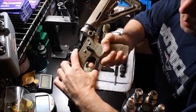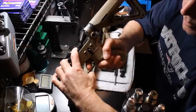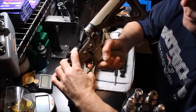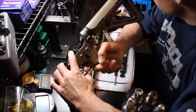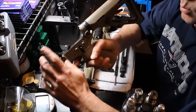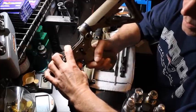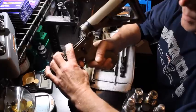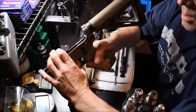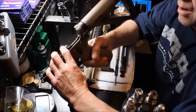So when you're pulling it, it's got two stages. That's what I want to go over here. Your first stage, there's nothing there. You can feel it stop, okay? And then for the first stage, the weight is 2.3 pounds. So remember I was telling you 7.6 is the military spec one that comes in here. So 2.3 pounds till it stops right there. And then as soon as I do a whisker more, it's going to release the hammer, okay? That second stage weight is 1.2 pounds.